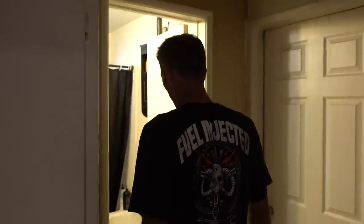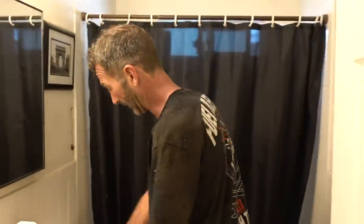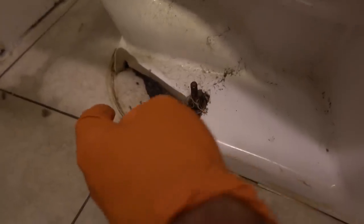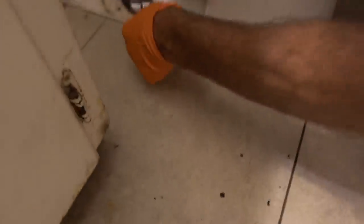I came to the toilet this morning and I noticed you guys may have these problems — it's a rocking toilet. You can't have a rocking toilet, that's no good. The bolts broke. This bolt's actually good; the other bolt broke on the porcelain, so it's not holding anything. Don't think that's poop — that's actually wax. That's the wax ring. We'll talk about that.